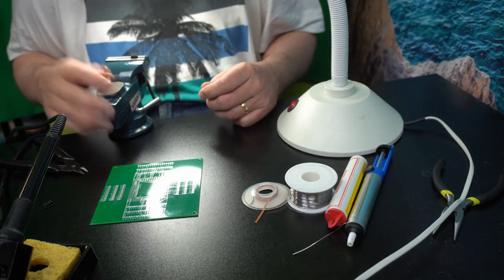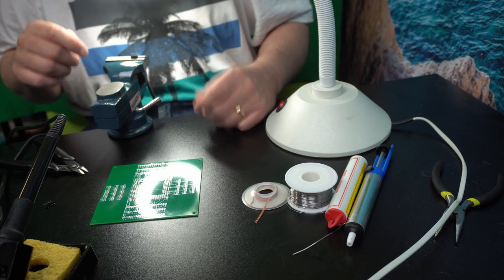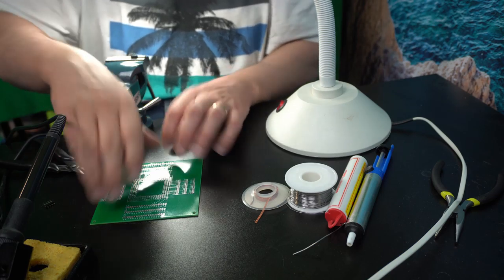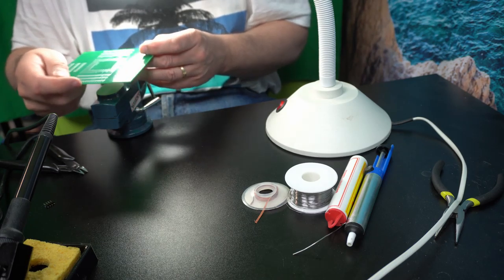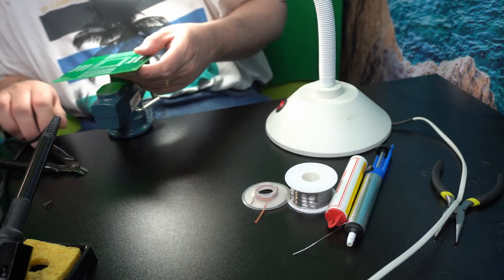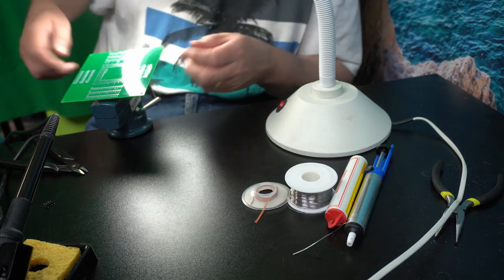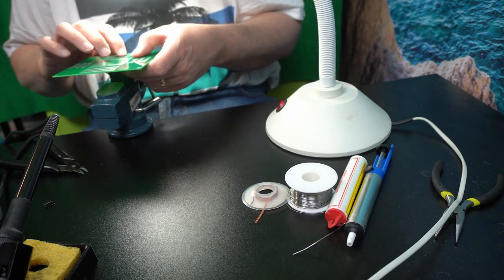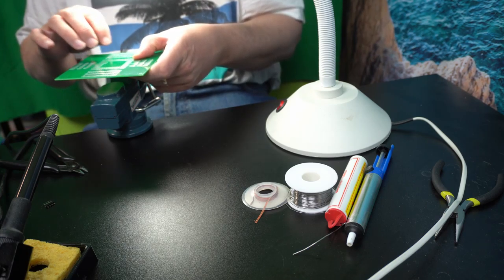So it's also good to have something in addition to an extra light, possibly like I have an embedded magnifying glass. It's also good to have something to hold things with. So I use this kind of vise, but there are also very many different types of grip mechanisms for circuit boards. I'm just going to have to experiment and see. And the most typical thing is that one actually burns oneself when trying to put in pin headers, because one tries to hold them on the other side.